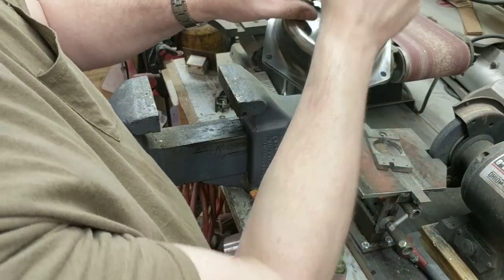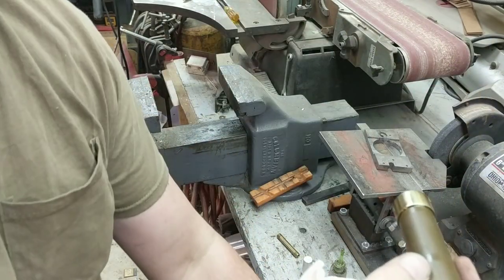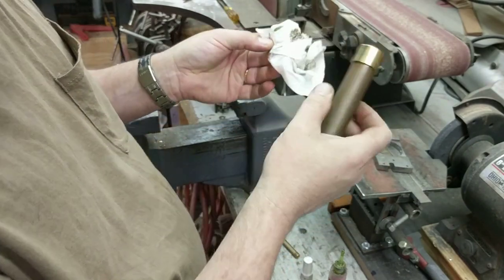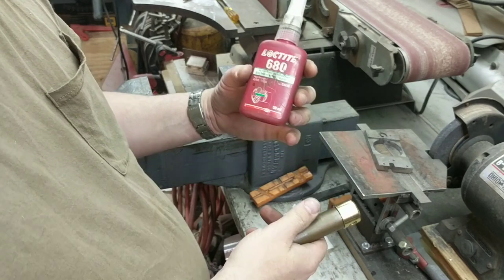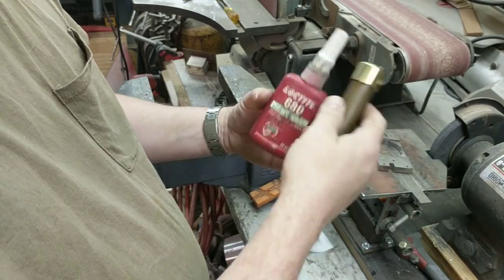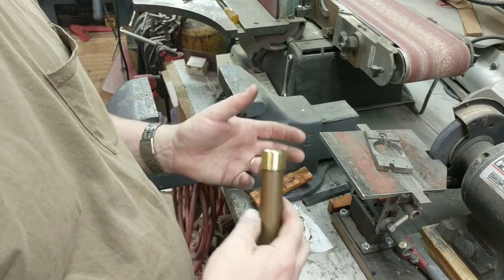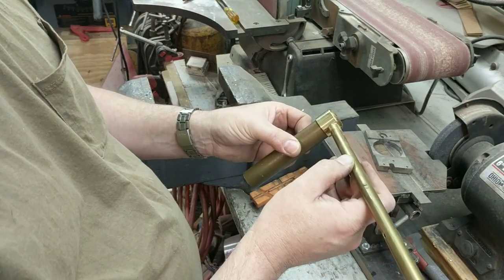When I bore the through hole that it's going to pivot on, it will actually go through both the fitting and the pipe, so there's no strength issue - this would be perfectly strong, never going to come off unless you heat it up to 450 degrees or whatever the point is that Loctite melts. By the way, that's how you use something like Loctite 680 to fixture a part - join something together, machine it, and then when you're done you heat it back up to 400 or 500 degrees, the Loctite lets go, and you take the part back apart. Kind of like in the old days of clock making when they used a heavy wax or pitch to hold a piece while working on it.